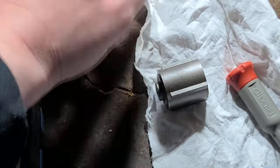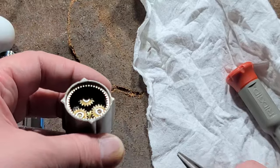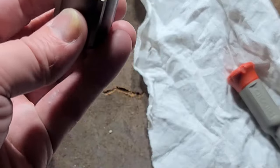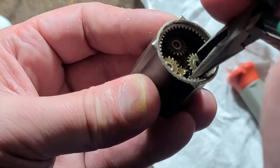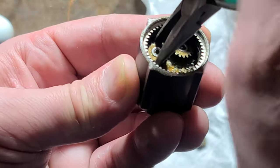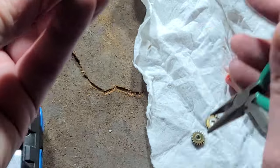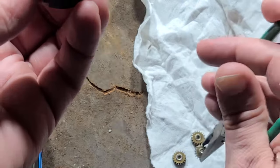It must have been just battling to make it over the amount of resistance it was encountering. So we do have a first stage that's all steel. I don't know why they would have used just such a terrible lubricant. It may not even know, but this lubricant is so bad it would have been better dry than having something that turns into some kind of paste.